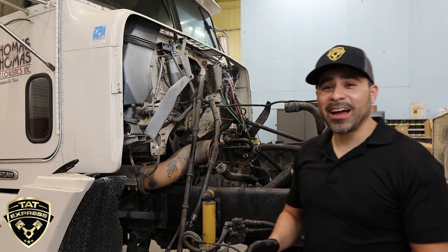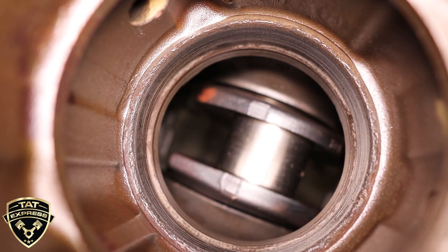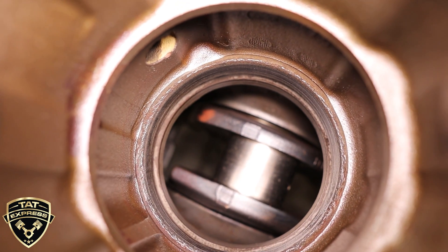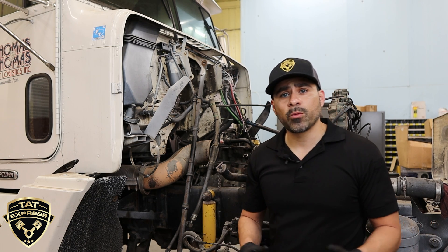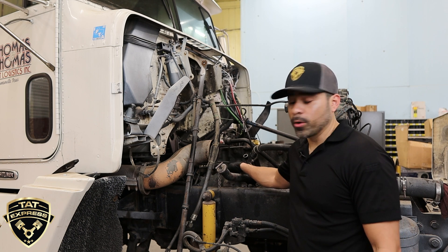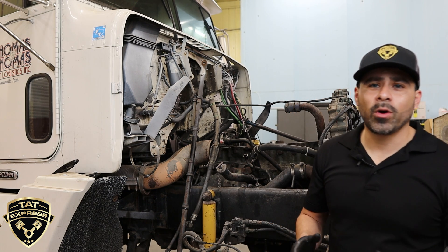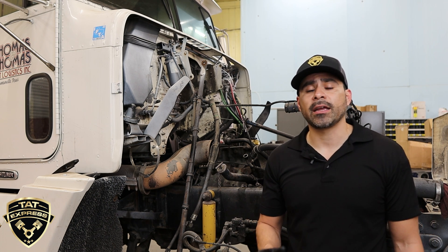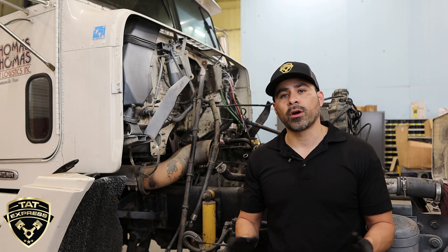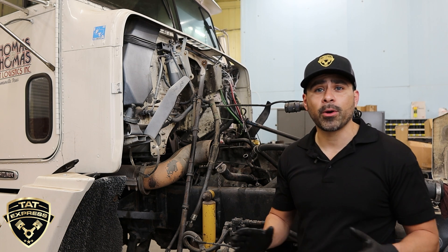Back at the block — I'll give you close-ups of what we see on the counter bores. There's a lot of erosion, especially where the O-rings and seals on the liners seal the coolant to keep it from dropping into the oil. Other good practice items during an overhaul: go ahead and replace the oil cooler, the water pump if it hasn't been replaced, and also the oil pump. You don't want the engine to overheat after a rebuild — overheating can destroy the new head and cause major issues.